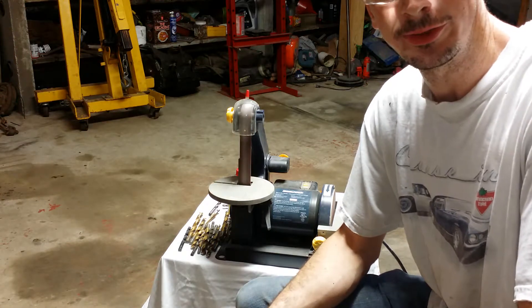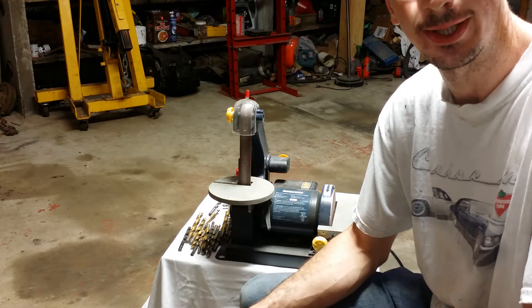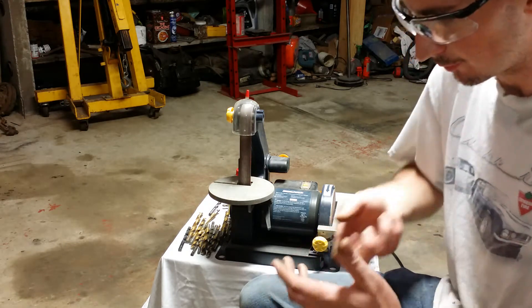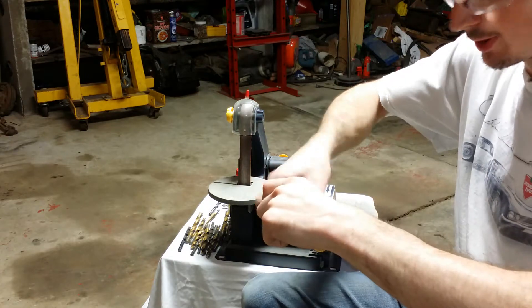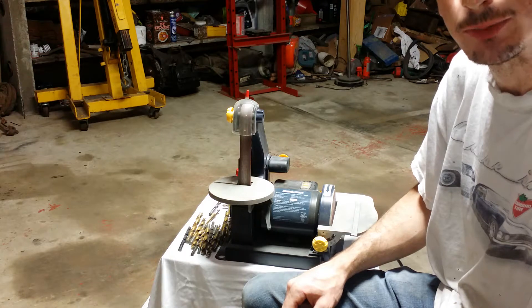The main key when you're drilling is just don't overheat your bit. Don't spin it too fast and keep lots of lube on there. One trick: if you've got a problem with it jamming up and you're using a cordless, you can use the torque feature — dial back the setting so it will kick out and start clicking if it jams up.